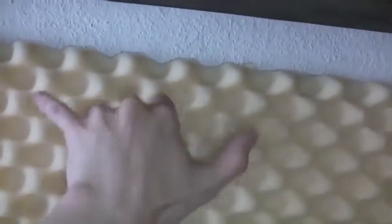You can even apply some force, and you don't need a lot of nails. I have one here, and you can kind of guess the distance to the next nail. It's here. Here I have a larger panel, so you have one nail here on the corner, one in the middle, and one in the corner again. The whole panel is 1 meter wide. So I held this up with just 3 nails here, 3 nails here in the middle, 3 here.